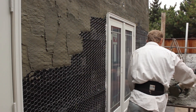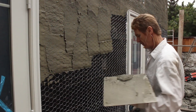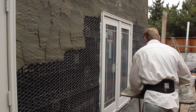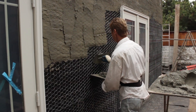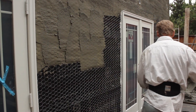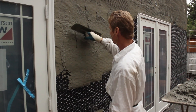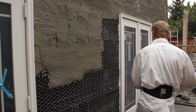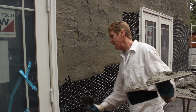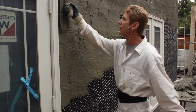Now notice when I plaster, as a rule, I'll sometimes just put the hawk here out of habit. You don't really need to do that, but if you look on the ground, that's how I plaster — I hardly drop any. I've had guys who plaster with me and at the end of the day there's two or three wheelbarrows' worth on the ground. But that's not what this is about. It's about how much you have to put on in order to know you've got a proper scratch. I say 3/8 minimum.